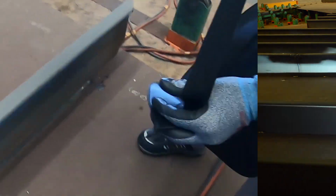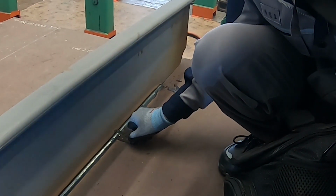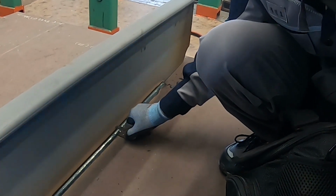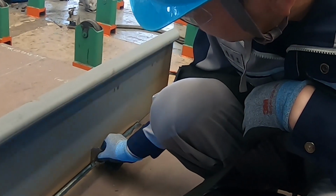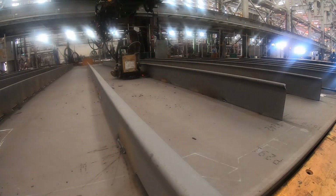When the angle decreases, the bottom leg length will increase, and undercuts might occur on the flange part depending on the conditions. Normally, the leg length is mostly measured by the upper leg length. The reason for this is that the molten pool squeezes down due to gravity during welding, resulting in a higher bottom leg length. Now, let's look at how to achieve the appropriate leg length.